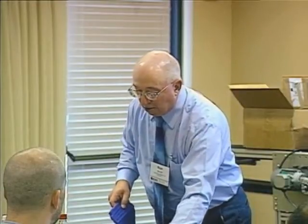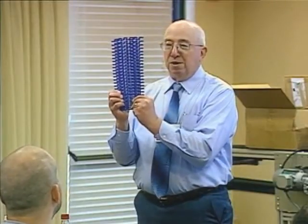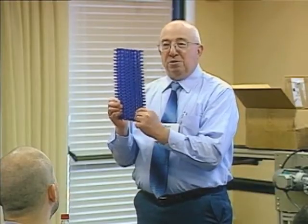It is done in straight running, which is mostly what this is, so it's just going to go straight down to the end and stop, just like we are used to with a fabric belt. It is also done in radius, so it'll go around a curve. It'll condense on the inside as it goes around the curve, open up on the outside, and when it comes out, it opens itself back up and runs straight again. So now, instead of having a transfer where that flat belt stopped onto a curved section, onto another transfer, and onto a straight section, you can run one belt around the whole mess. There's a lot of engineering that goes in here as far as turn radiuses and all these other things involved, but in essence, that is what it is.